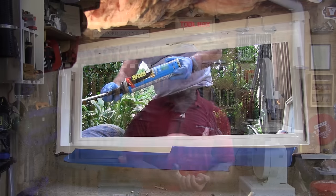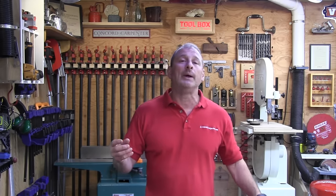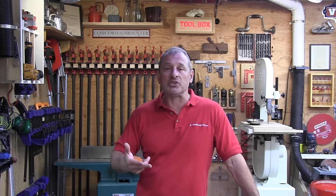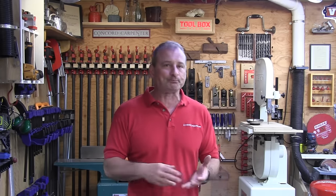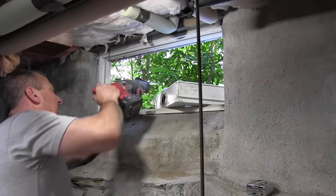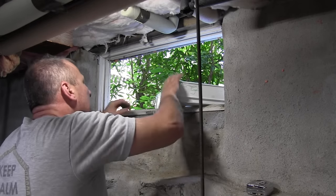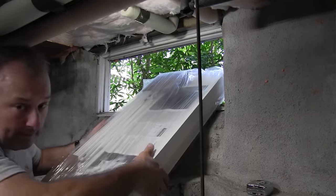On metal window frames, you need to determine what parts of the metal buck can be removed and what can't. Sometimes they're embedded and tough to get out because of poured concrete foundations. So unless it's severely rusted, sometimes it's better to just leave it in place and work around it. You can use a cold chisel, reciprocating saw with a metal blade, or a pry bar, but it's an arduous task. Sometimes it's better to just take out the frame and leave the metal buck in place. If you do leave that metal piece in place, you need to order a smaller window — measure from metal to metal, and that's going to be your new window width.